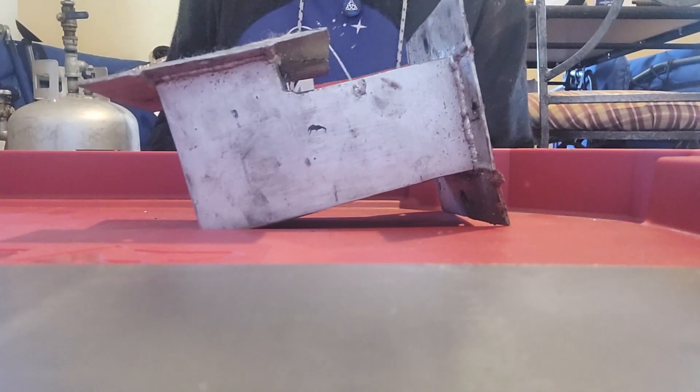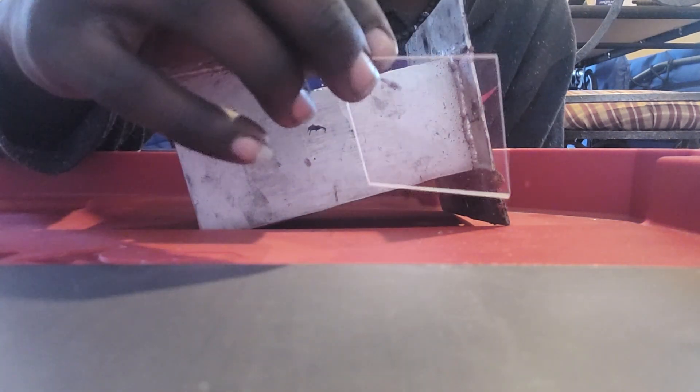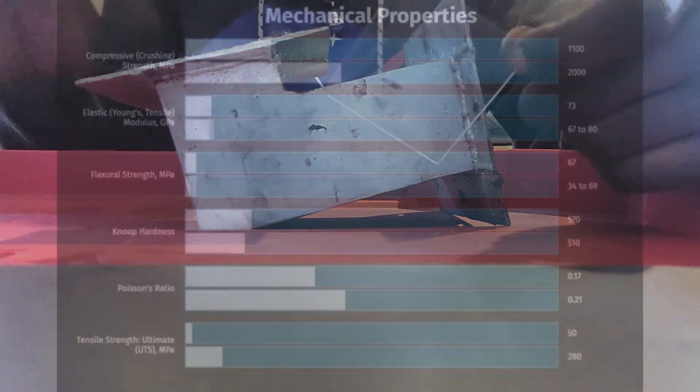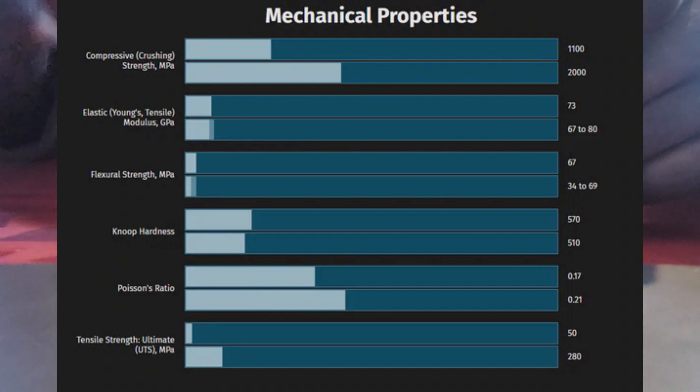Now, the big boys up in the big industries, what do they use? They don't use that stuff. They use things like this right here. Pure quartz glass — 99.99%. Quartz glass is not just regular glass; this is made of quartz. So it's very high temperature resistant. The melting point, even compared to borosilicate glass or Pyrex, is way higher. And on top of that, very high pressure resistance, low thermal expansion. That's usually what messes up glass, because the glass will shock under thermal expansion — if it heats up too fast, it starts to grow, the glass crystals start to grow, and it can't handle that. It shatters. But this has very low thermal expansion, especially in comparison to other glasses.